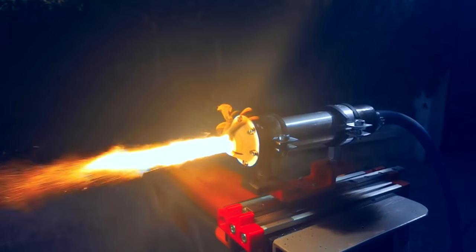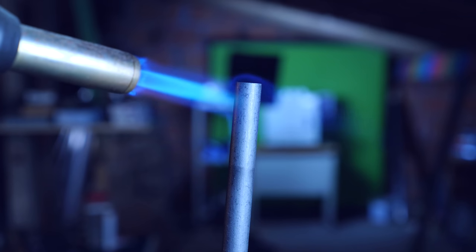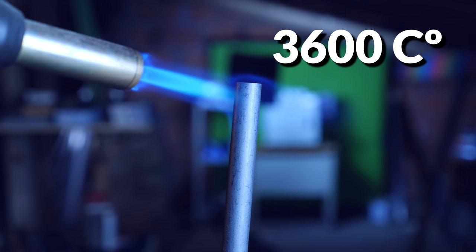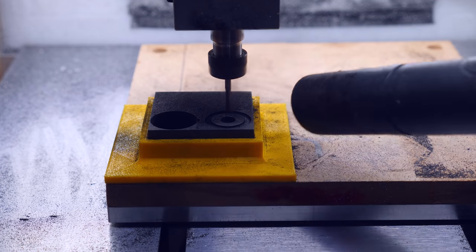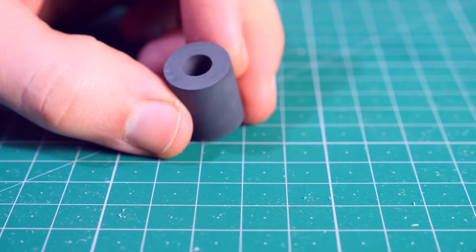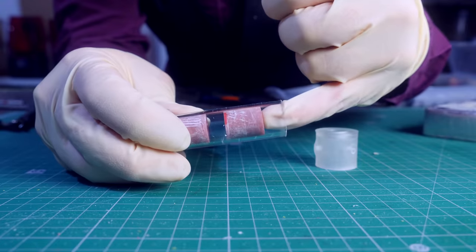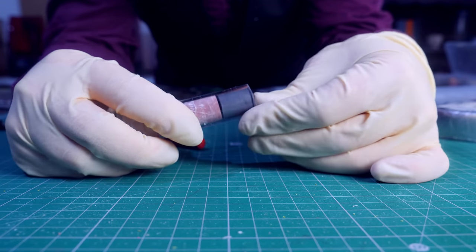I did all of this to design my nozzle, but because I had no idea of the performance of the 3D printed fuel, I kind of pretended I was using rocket candy — which is sugar and saltpeter. I have a design for the nozzle, but I still need to make it. In the past I tried many processes to fabricate nozzles and they all failed miserably, so this time I followed your advice. I got some graphite blocks and used my CNC machine to get the geometry. Graphite can withstand temperatures up to 3600 degrees Celsius and it's pretty easy to machine, even though the fine dust makes a mess everywhere. I could only machine one side, so to finish the other side I used my drill press. With the propellant grain and nozzle ready, I used an acrylic tube as the body and 3D printed some resin plugs to hold everything together. Assembling the rockets was actually very easy, and to my surprise all the dimensions were perfect.